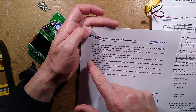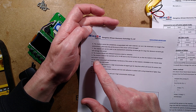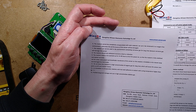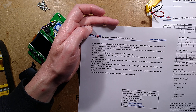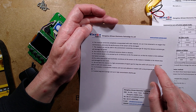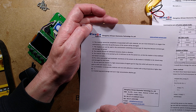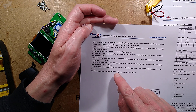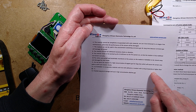It can't be used in an environment containing corrosion gas — no shock or vibration. It needs to be warmed up for 24 to 40 hours at the first power-on so the module is fully stabilized and tested normally. I haven't done that, so maybe I should leave it powered up, plugged into the USB, and just leave it running for a couple of days. The white breathable membrane on the sensor is forbidden to be removed. It is forbidden to encapsulate modules with hot melt or sealant with curing temperature higher than 80°C.